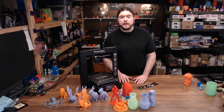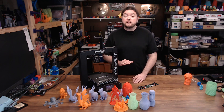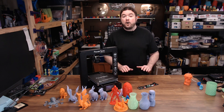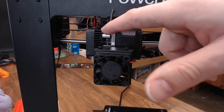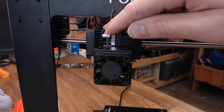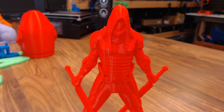A user told me to try thermal paste on all the metal surfaces, and that did help some, but it only bought me a little bit more time in the print and it still eventually failed. I also adjusted the extruder voltage as low as I could go to save on heat — still no luck. So I went all in with one last mod: I ordered an all-aluminum extruder arm and plate from Micro Swiss. Not only does this grip the filament better, but it adds to the thermal mass. With the added mass of the extruder plate sandwiched between the arm and the heat sink with some thermal paste and the fan, I was able to get the heat creep down to a minimum, and the prints since then have turned out pretty well.